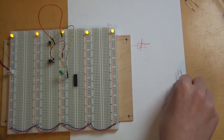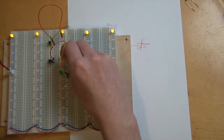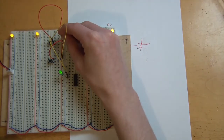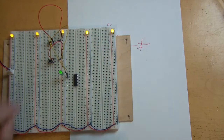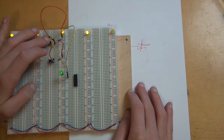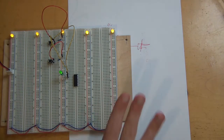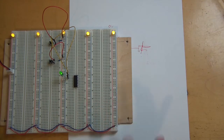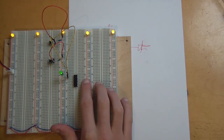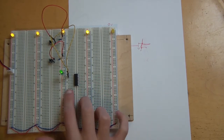So let's do it — adding 10K resistors to all the inputs. I also used wire bridges to have a constant plus 5 volts in here. That's plus 5 volt, and that's ground, just so it's not too cluttered. With those four NAND gates you can build every logic circuit — AND, OR, NOT — any circuit with those four NAND gates in here.